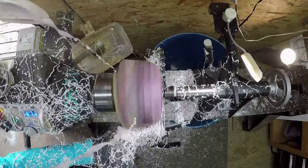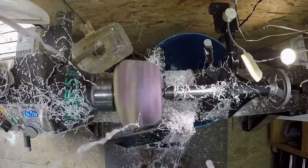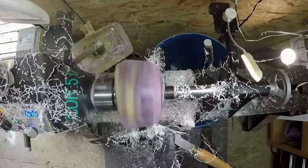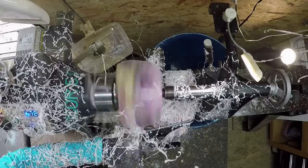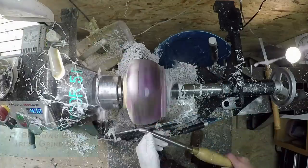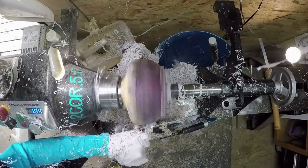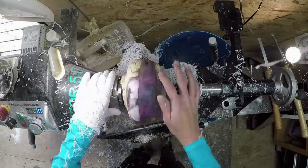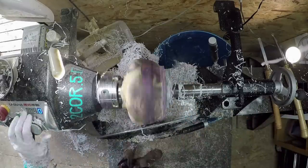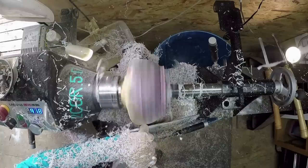The point was just to save the wood and utilize it. Negative rake scrapers work really well on resin, except when you're impatient and can't turn very fast because it's wobbly. I chose to go at it with my bowl gouge, and it does chip out when you go really fast — but I knew I was going to be taking a whole lot of material off. If you intend on keeping a lot of resin and you're near your final shape, I wouldn't suggest using your bowl gouge because it just shatters and chips like crazy. I had planned to take a lot away, so I risked it.